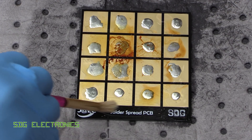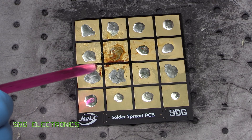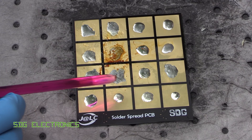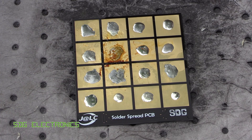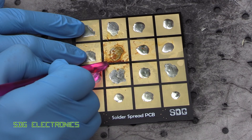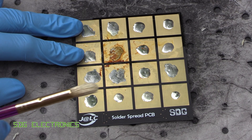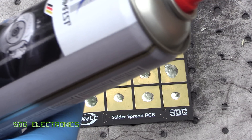So it doesn't seem to be lifting any of the solder mask or anything like that on the board. This brake cleaner has behaved very similarly to the flux removers that I've used in the past. All of the fluxes around the outside that were a little bit more normal have come off without any problem. Also, you'll see that the solder mask and the silkscreen have remained completely unaffected. It's only the area that had the very heavy rosin flux that looks like it just needs some additional manual abrasion — if you give it a little scrape it comes off, but basically it's crystallised onto the PCB. The ones where you've got very high rosin content just don't want to come off the board, but actually this looks to be relatively gentle.